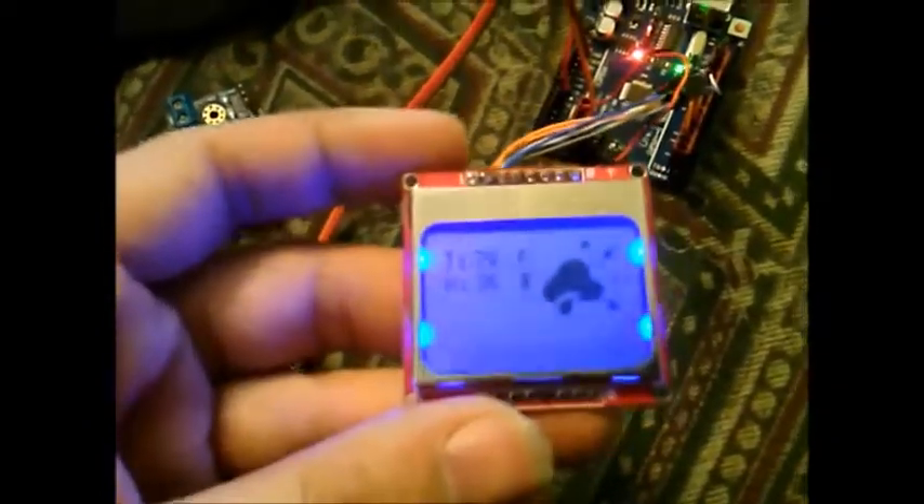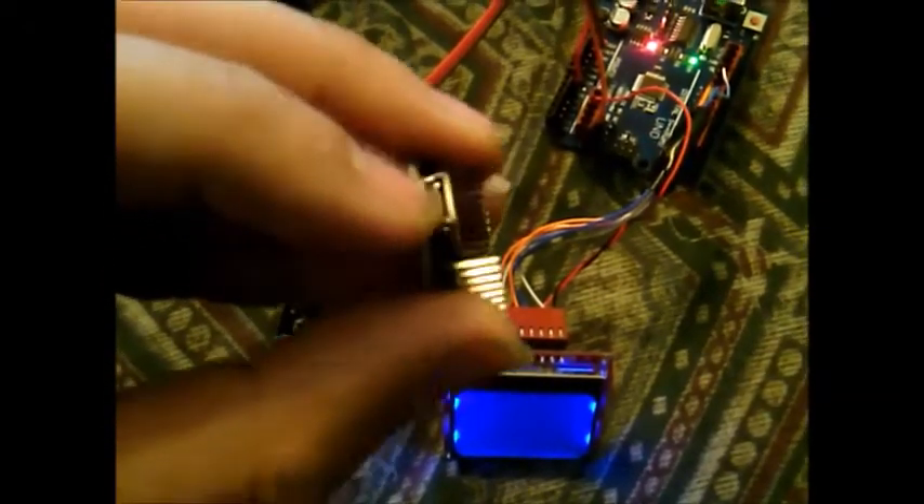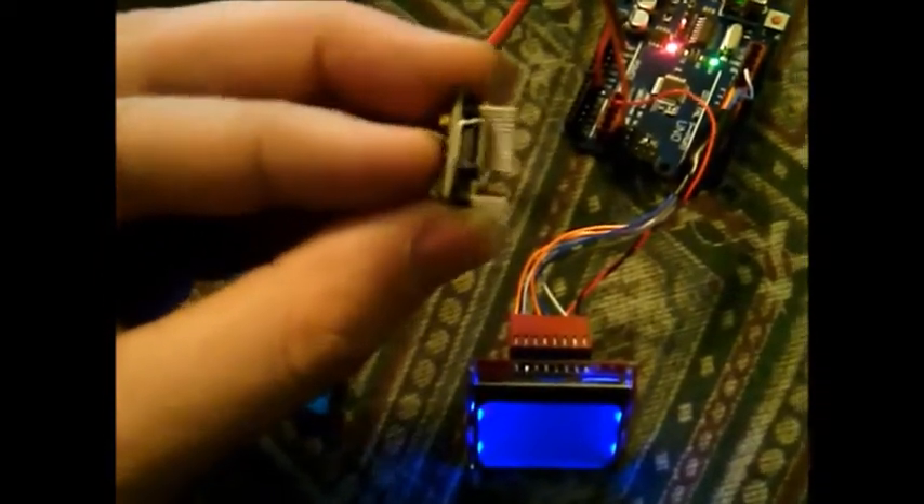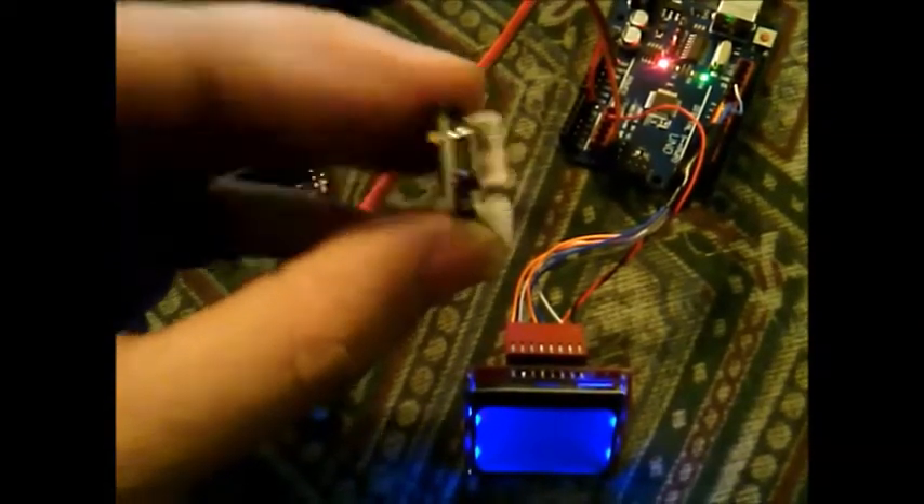The project plan is that the screen is going to stay here. I'm still waiting for the RF links to come in for this system, but I'm going to be moving this piece onto a Nano with power coming in. I could possibly tap power from one of the other pins, but I'd rather get it through here because there is a protection circuit — there's a fuse protecting it.